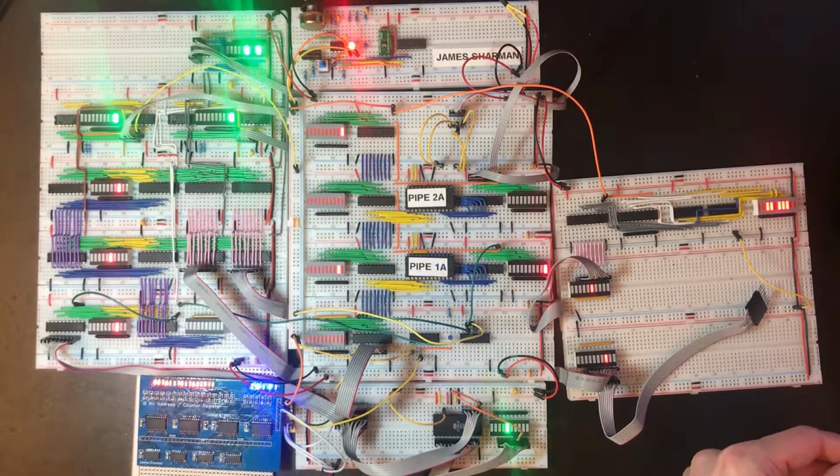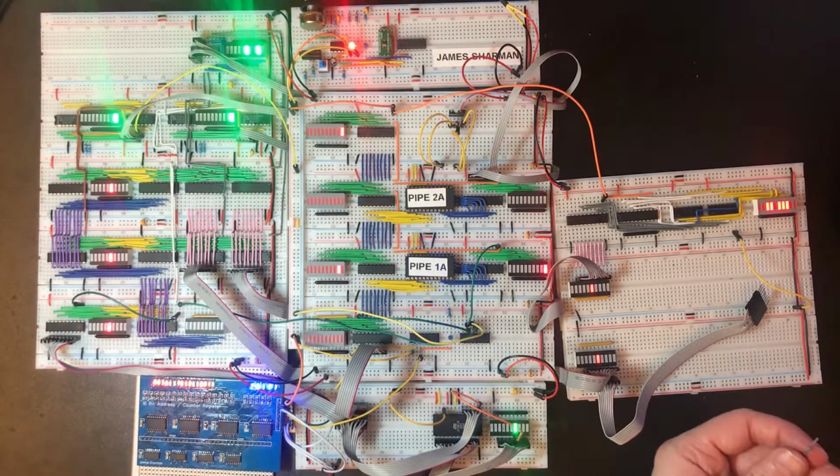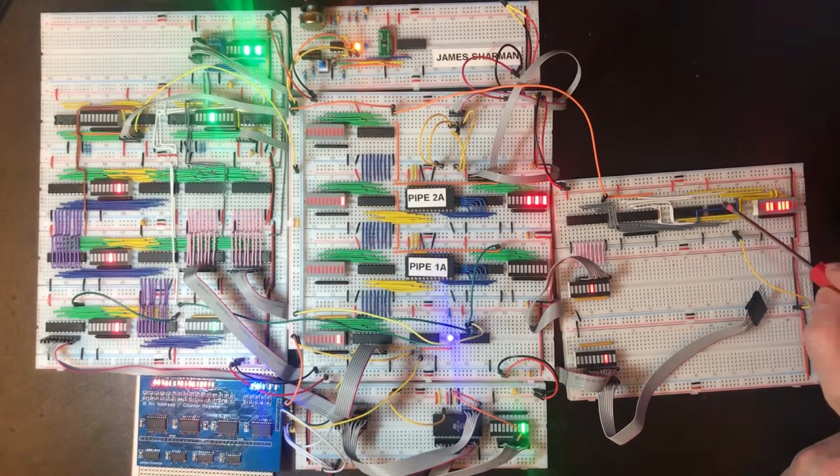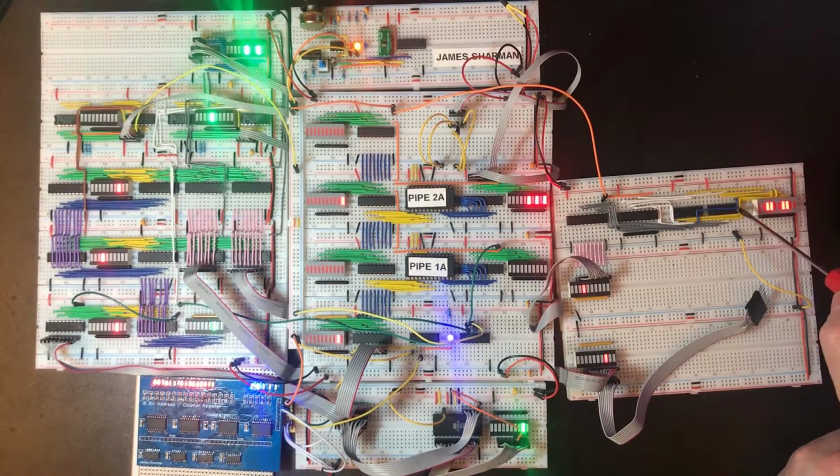I joked earlier about liking these particular adder chips because they got the word fast in. But the exact terminology is actually with fast carry. And that's kind of interesting. So if you think about each of these, you've got 3 separate inputs. 2 4-bit inputs, which are 0 to 15 each, and the carry input, which is 0 or 1. And effectively it produces a 5-bit result, which is the addition of those 3 values.